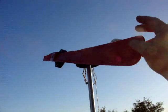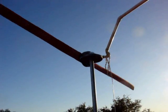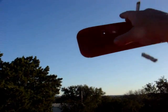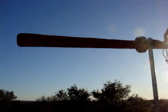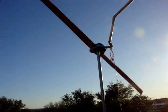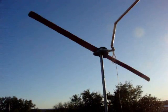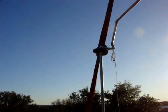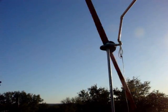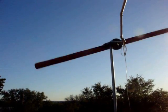It doesn't take much to start it off. I don't have it aimed into the wind and there's not much wind — notice it didn't yaw into the wind — but I'll give it just a little touch, let it turn, then back off and see if it'll take off. Once it gets past that first cog it makes it a lot easier. It's turning rather slow; a long blade turns slow. But once she gets to cut-in speed, you'll notice she takes off rather abruptly — that venturi curve has to get up to speed and start cutting the air before it starts getting lift.